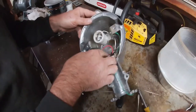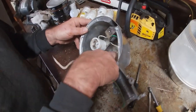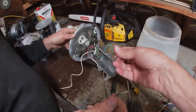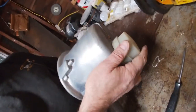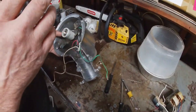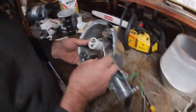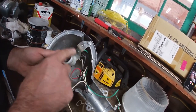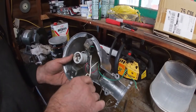Okay, so explain to everybody again who's doing this, where you put the red. Yeah, the black wire coming in, this comes in from the line voltage at your house, going out to the light. It goes into this light sensor, the dusk to dawn sensor. Since that sensor requires some power, you also have to give it a common or a ground, we'll call it a common. So it gets attached to the white as well, as will the light bulb, because your light bulb needs the common as well. So that's why these all get tied together.